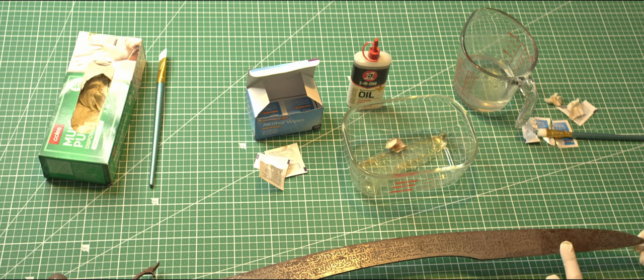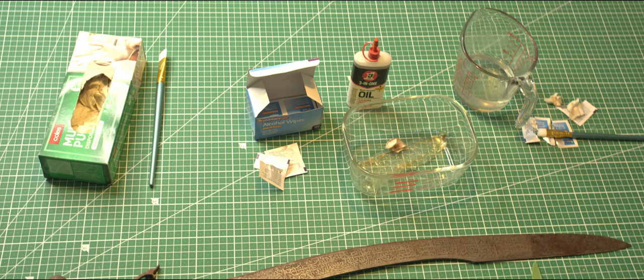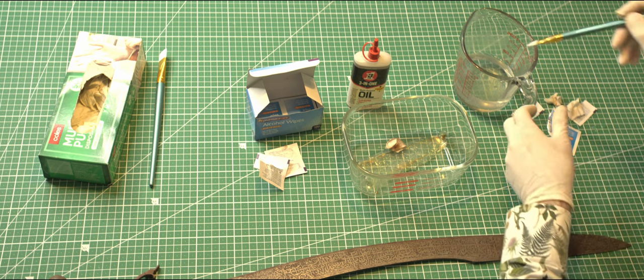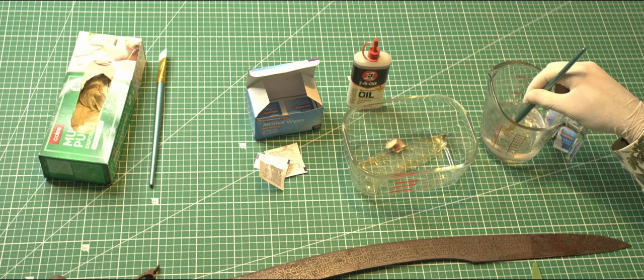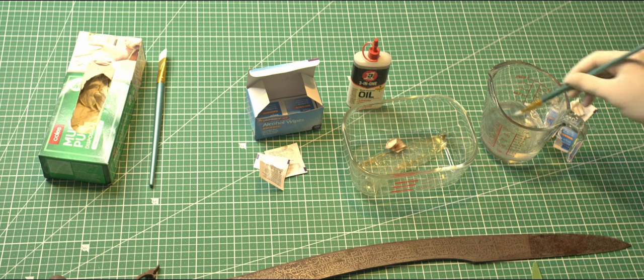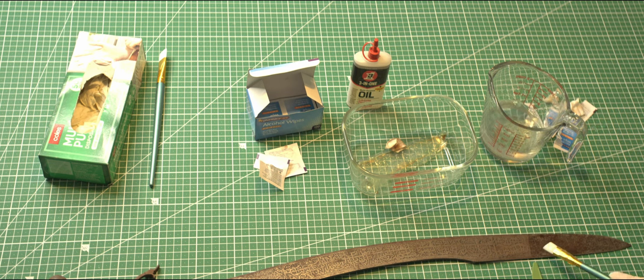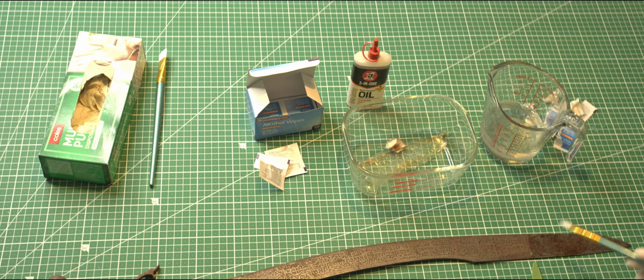Now I am going to clean this up with an alcohol wipe once again to see if anything comes off — and that will tell us how effective the treatment has been before we proceed. That is a pretty substantial amount of iron oxide on this wipe, and there's more to be removed clearly. But you'll note that the bright orange edge that was on either end of the gel came off with the gel and has not marred the surface of the sword. It is looking like some of that corrosion is still present, however that simply means we're going to address it in the polishing stage or do another application. No damage has been incurred and all of the detail in the inscription is still perfectly visible. Let's now move on to the obverse side and repeat the process.